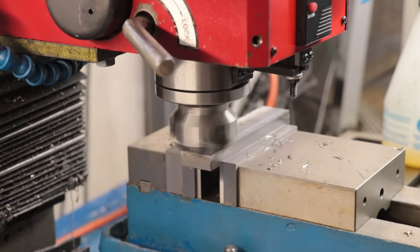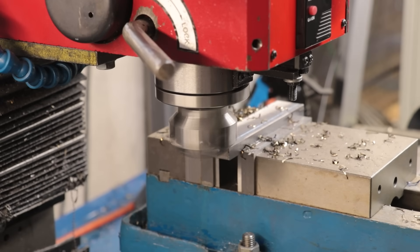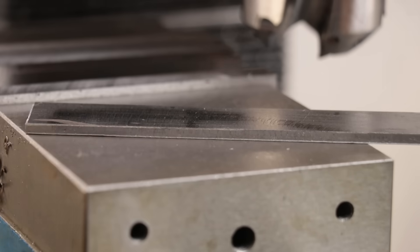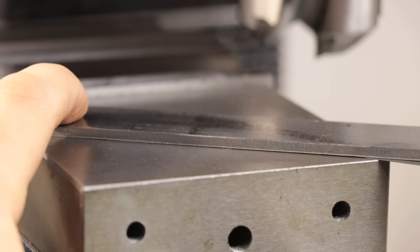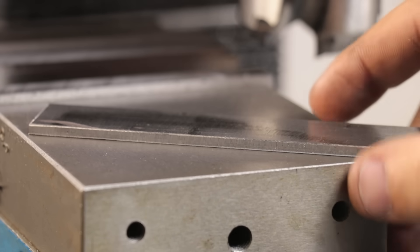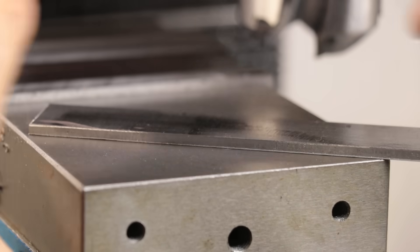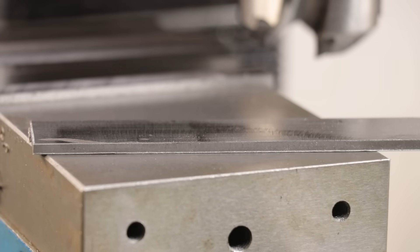As a better visual example of just how bad it can be: a while back I took a piece of 12mm steel plate and milled about 10mm off one side. After taking it out of the vice — the piece which was perfectly flat beforehand — I could now get a 0.1mm shim underneath it. That's a bit of an extreme example, but it shows that internal stress in metal can easily warp a part. With the parts I'm making this time they need to be quite accurate, so even 0.05mm would take them out of spec.